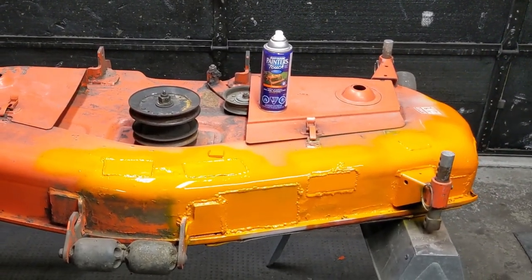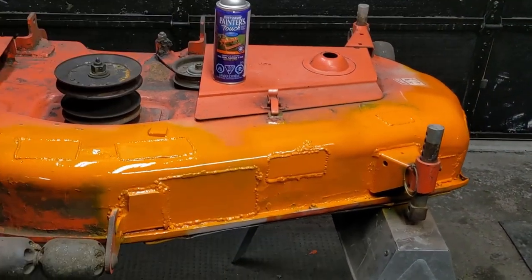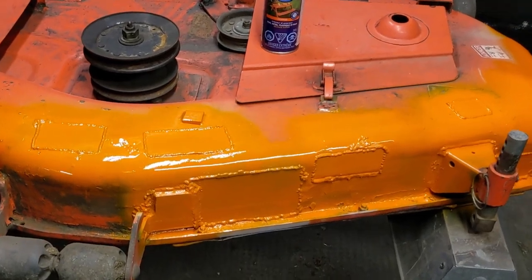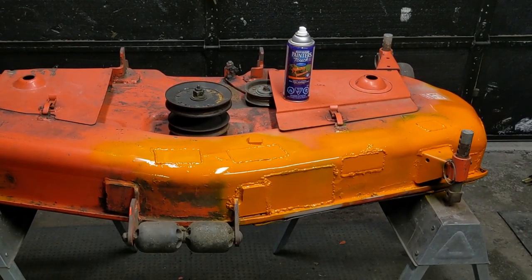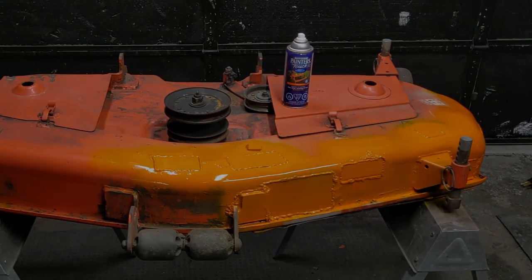I got the mower painted up - just the first coat, I'll probably hit it with a second coat. It may be picking up as yellowish in the camera - the LED lighting kind of throws off the white balance for recording. I'll probably get a couple more coats of paint on this mower deck and then I'm going to flip it upside down and undercoat it, sharpen all three blades, and then reinstall it onto the mower. I'm not going to film any of that because I have separate videos covering those topics. That's going to wrap up part two of this Kubota mower deck repair - if you guys enjoyed the video think about leaving a thumbs up, you can click here to subscribe, and as always thanks for watching.